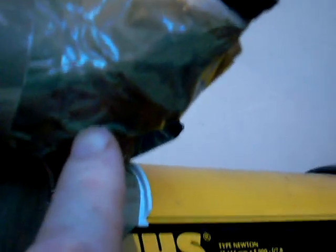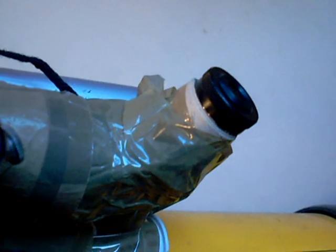If you get one of your adapted binocular lenses here, you have a tube at the back of it, and you use a binocular prism and a binocular lens, or an old lens from something else like a toy microscope, and you've got yourself a decent spotter, which you've mounted on your equatorial mount. That becomes incredibly useful, especially for astrophotography with a webcam or with a cheap digital camera. I have a cheap digital camera which I can use.